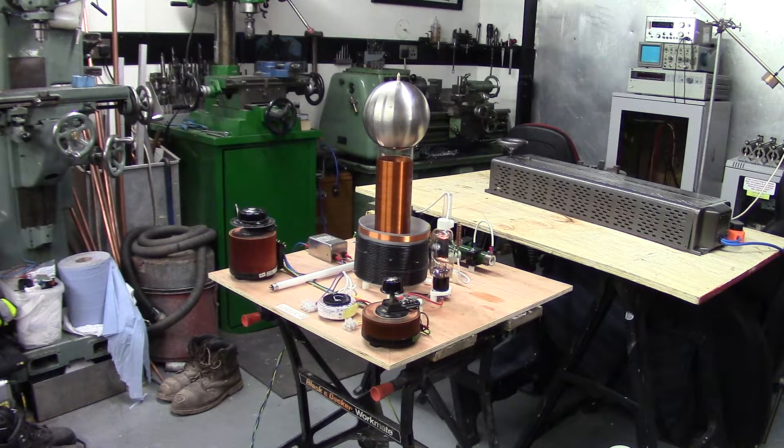I tried removing a few grid coil turns to see if I can lower the voltage a bit. I didn't want to go too far below because I'm already at 22 turns and 25 is what Steve Ward asks for in the circuit, so I don't want to go too far below that. But yeah, that's working now.